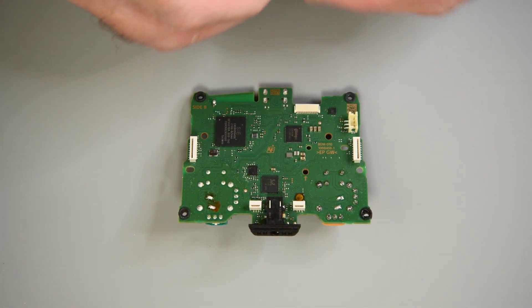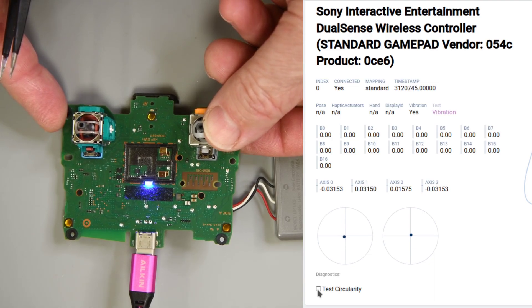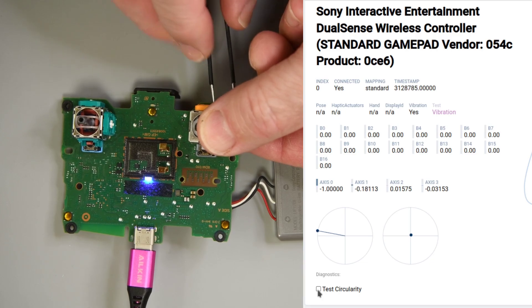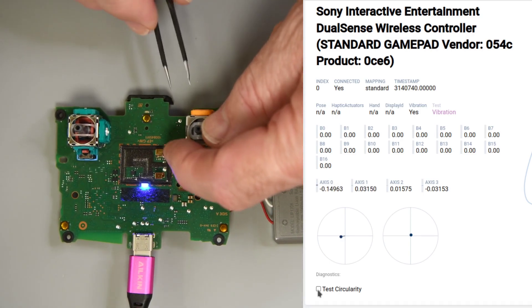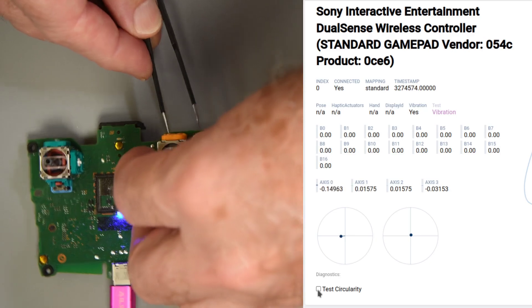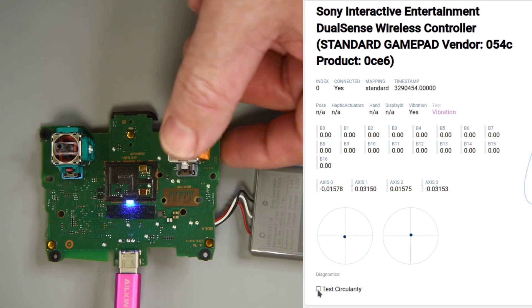Fortunately, I don't have to have all the flex cables hooked up to test and set the joystick center. I'll hook up the battery, then the USB cable to the computer. Neither axis is off-center a whole lot, but let's see how close I can get it. I can sure make it worse, but was kind of expecting that. It's just going to be a process of going back and forth till I get it where I want it. There is some hysteresis in the spring system of the joystick module, so it won't return to the exact same spot when moved. I'm stopping the left-right adjustment here — I think it's a bit closer to center than before, and it didn't take long. Under three minutes to get it close enough — not really as bad as I was expecting.